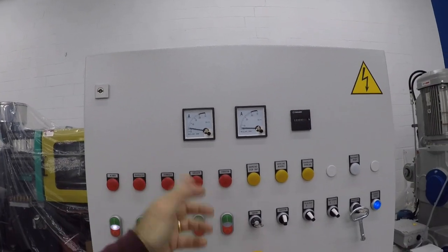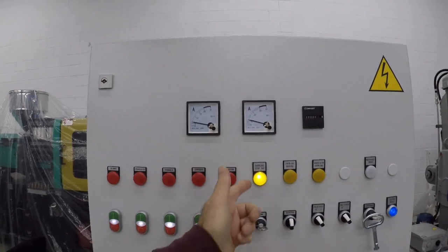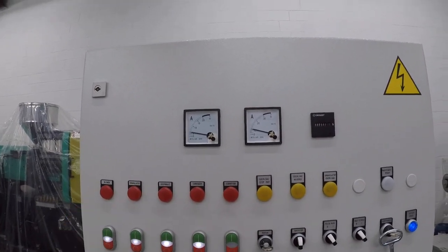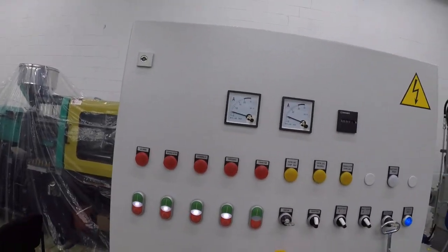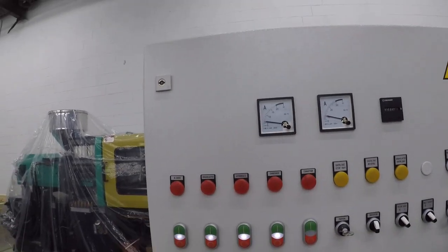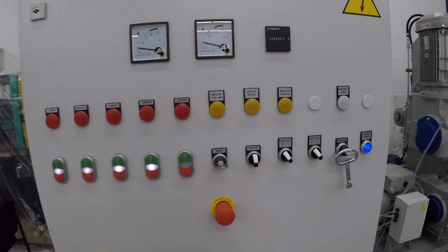Next is the hydraulic unit for the RAM, then the shredder. It just goes on into the initial shredder, gets working, then settles — that's just the amperage. What's important is that if either the granulator or the shredder amps up, the RAM will immediately pull back so we're not overloading the machine. Everything's working and going right now.